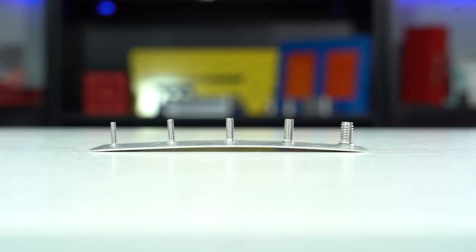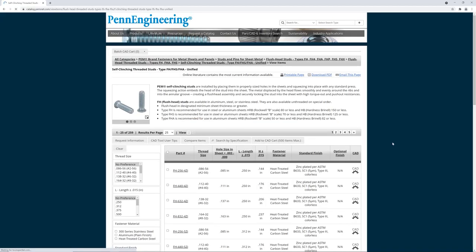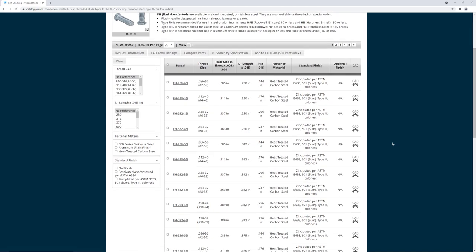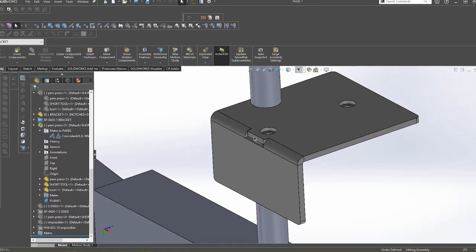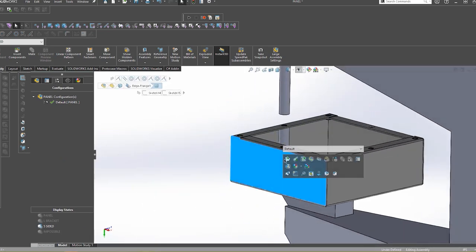These fasteners require a large installation force, which has also warped the material. We stock a wide variety of fasteners with different geometric features, and these geometric features will dictate the minimum material thickness. You can look up the specific fastener you're looking to use on the Penn Engineering website, where you'll be able to see the minimum sheet thickness for the fastener as well as lots of other valuable info. Our engineering and design services team can also assess your design to make sure your material is thick enough for your desired fasteners.